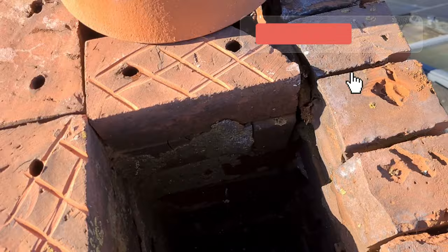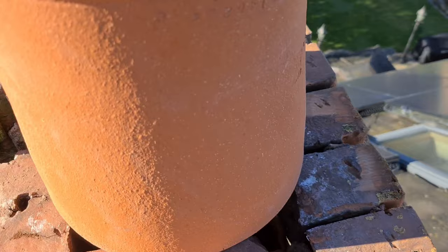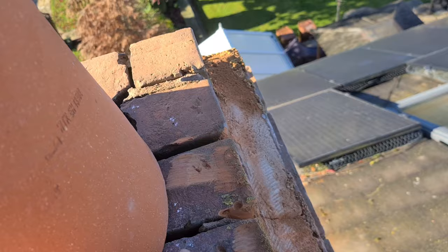We've got a couple of pots to put on here. What I've done is I've just ground the top off and got rid of all the moss — I've also done it on the side here. I've put a little scar mark on here so there's going to be another pot here. You can see I've got one sat there, but they only just sit on, so these gaps here — what you need to do is put a piece of slate across. So I'm going to get some slate, bridge the gaps, and then it'll be mortared all the way around it again.